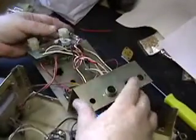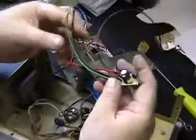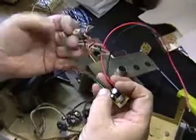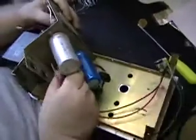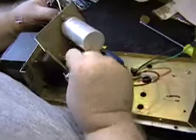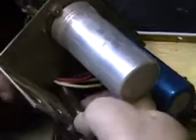What we're going to do is take this unit here. You'll see there's two sets of wires: one is six inches long and the other is almost a foot long. What you want to do — since you've removed the ones that were there — is try to feed them through the grommet, or any other available hole, as long as they don't short out. We'll try feeding it through a grommet. There's your black lead, pulling it through.